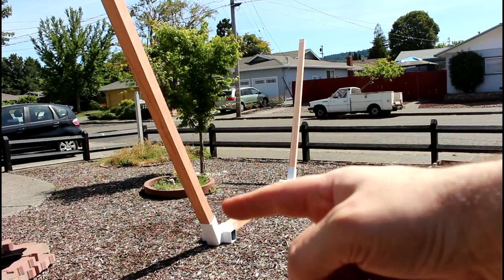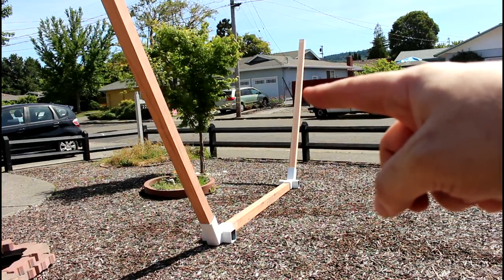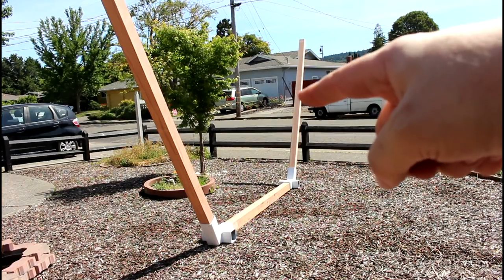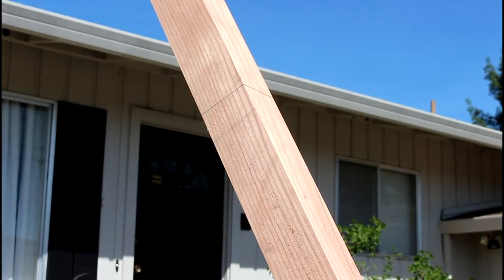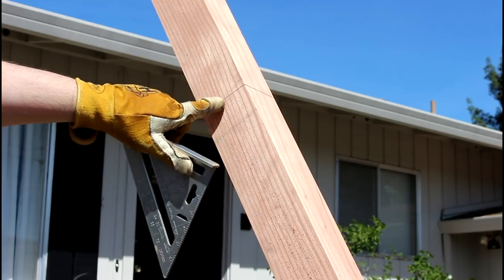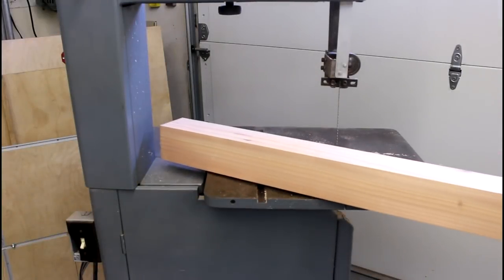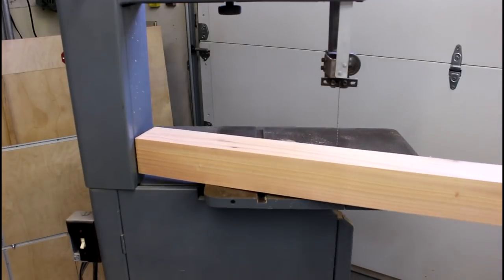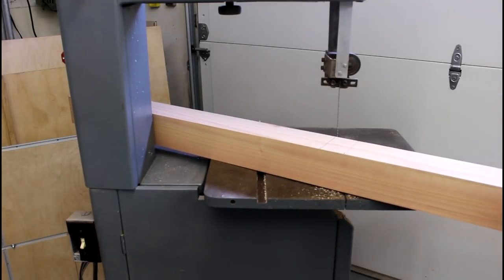So here it is assembled — these are all eight feet and as you can see it's gigantic. I needed to put it together so I could know how high to make each one of these posts. A standard hammock holder from the store is four feet off the ground, but I've got plenty of room so I'm going to make mine five feet off the ground. I'm going to use this measurement for both and cut that other post to match. I don't have the capacity to make that cut on my bandsaw, so I give it a little twist and cut out the waste area.